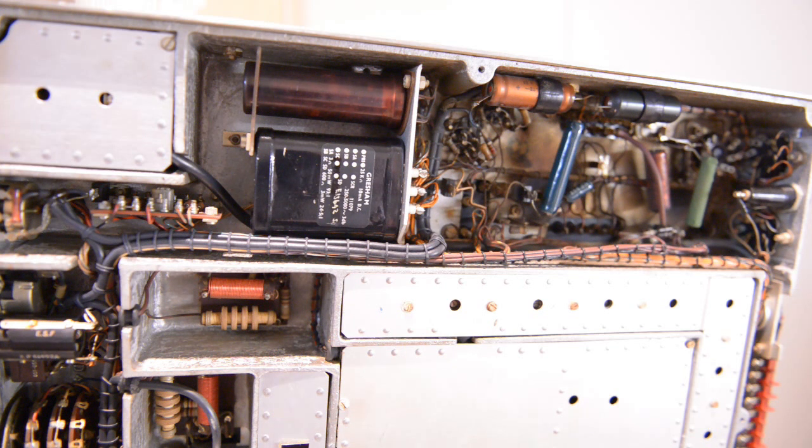I've tested this — I put the voltage on and drove the voltage up on the transformer to its maximum. What appeared to me is that the front end isn't working. What does that mean? The third mixer, the first IF, second IF, the AGC — the LF part of it, that's all working. The BFO is working, everything was doing its thing, but the front end is not working.